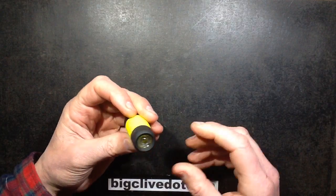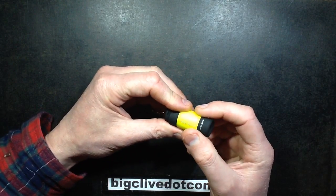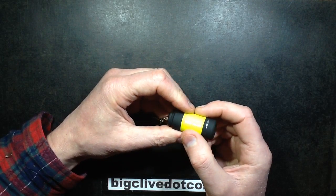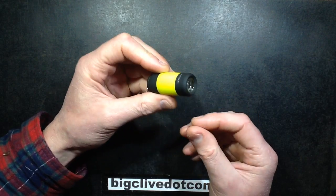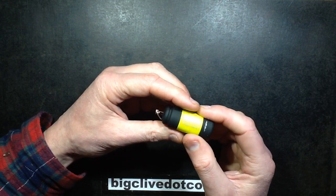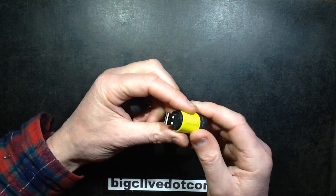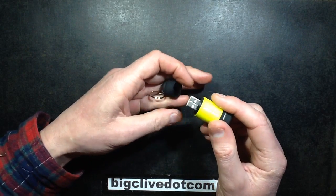The current was so low that I wondered if this was even recharging at all. I had to rig up a little USB socket to the power supply and put a digital meter in line to find that it was drawing about 2.25mA when charging. So I wonder what charging circuitry it's got and whether there's any protection — let's open it shall we.